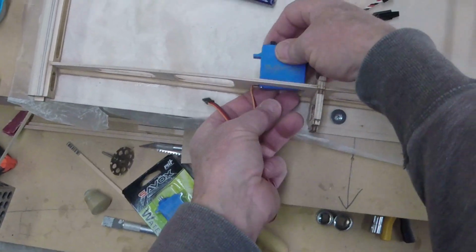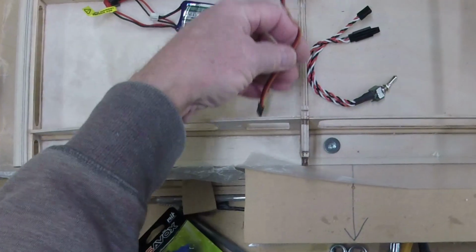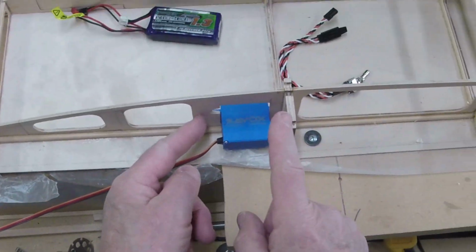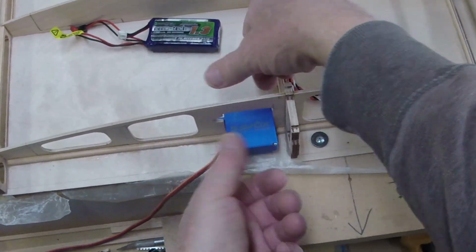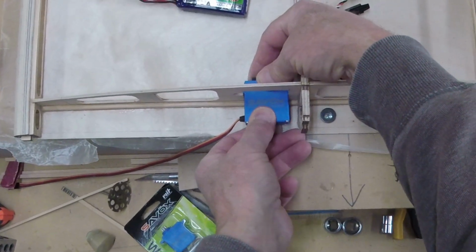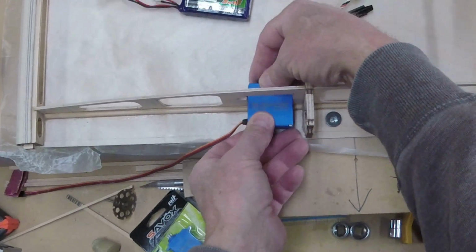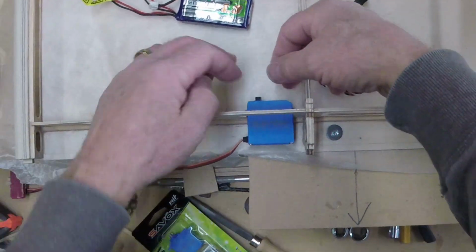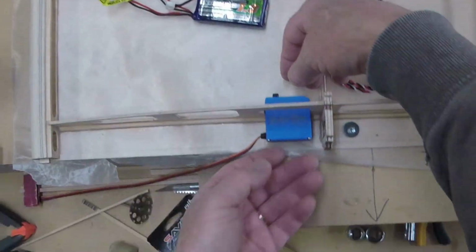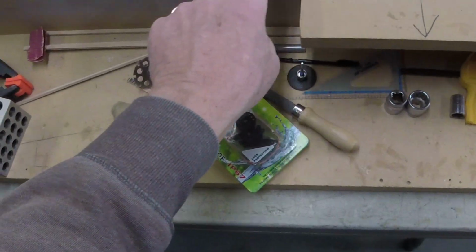All right, so here's a couple things you're going to do. You can do this right now if you want. Cut this guy out. Make it fit snug, right? Because when this is in there, sure, you're going to have the screws in it, but the more you can rely on the wood to prevent the rotation this thing is going to attempt to do when you're steering, this thing is going to try to turn. You want it kind of snug. You'll see there's a little bit of play here. Once I put sealer and stuff on here, the wood will actually swell a little bit and it'll tighten. But nonetheless, it's going to have screws in it. And the more snug you can make it, the less it relies on the screws and the less it will tend to wiggle the screws loose. Okay, so do that. Do these cutouts now if you want.